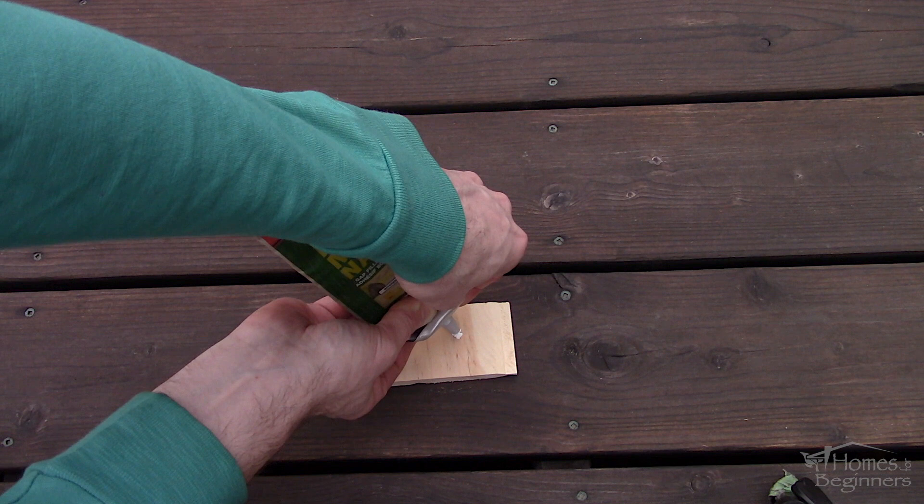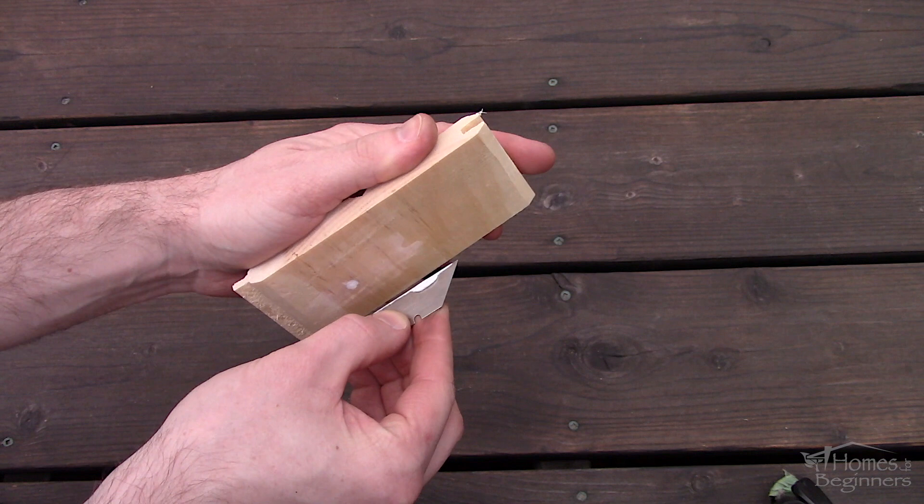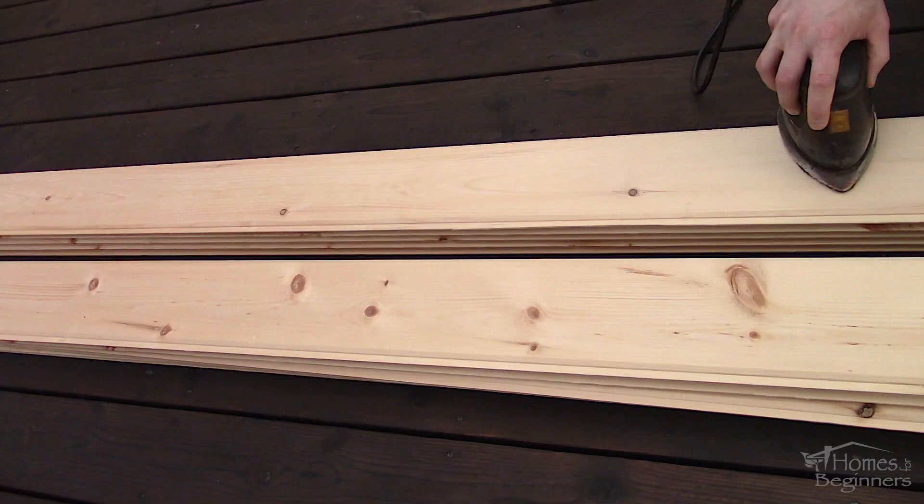Here I'm giving a brief example using a cut-off piece of wood. Fill the hole as needed, then drag the razor knife over the surface for an even fill. Allow it to dry for 24 hours. Depending on the depth of the filler, there may need to be another application. Being that this glue is white, it blends in very well with the whitewash after it's been applied.